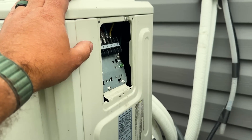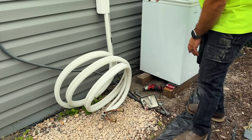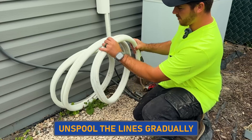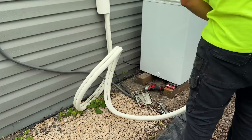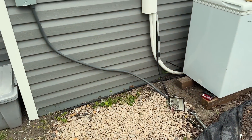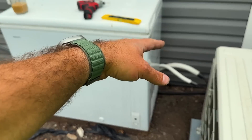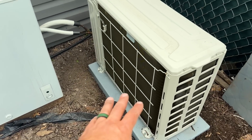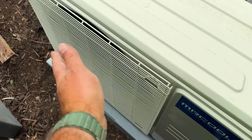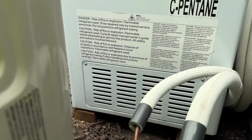Now what we're going to do is slowly work these line sets behind our freezer here. We're not going to pull this out like this — we're going to unspool it gradually, just being careful not to kink these lines. We have our line set running; it still has a little bit of a spool right back here. That line is actually a lot longer than it seems. This is where we permanently mounted the condenser — we leveled out this pad, secured it with some screws. It's going to be outputting air this way, and our lines are going to connect right here. We still have our spool there, which is totally fine.